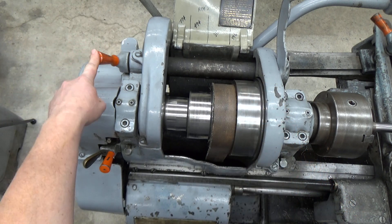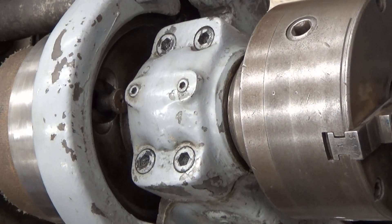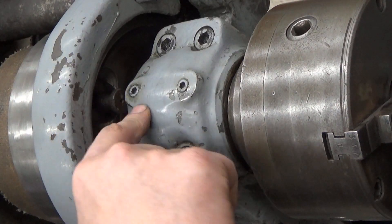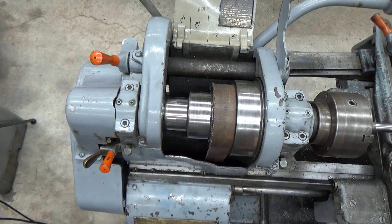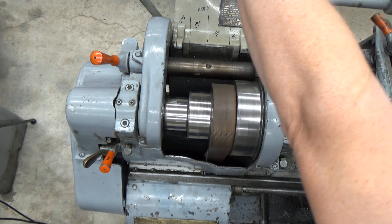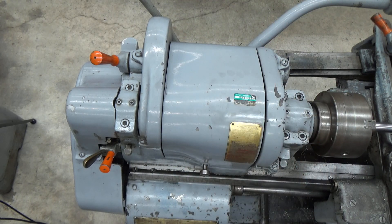So this is the back gear engaged and this little pin over here is in its downward position. In that configuration with the back gear engaged, this lathe is going to spin at much slower RPMs. That's how we can change from high speed into low speed operations — this particular model is set up to have eight different speeds: four high speeds and four low speeds with the back gear engaged.